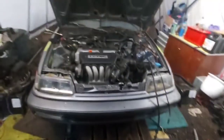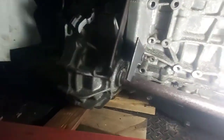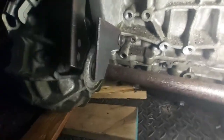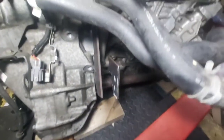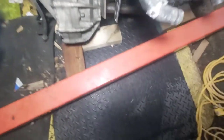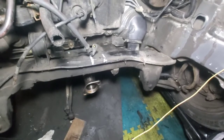I've got the engine back out to make this final rear mount. I've got my piece going off of there, and this one goes through there. I need to connect them — they are at about the right angle they need to be. I took a marking across from the one that's bolted right in there. I've got to weld my two tabs to the subframe, and then that should be it — that's where it needs to be.